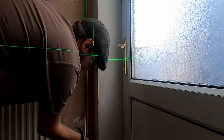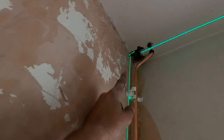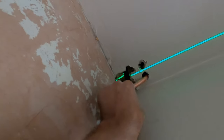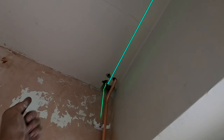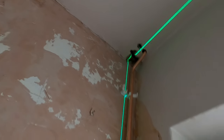I've got to try and hook this — I might need to shorten that leg a little bit. That fit first time, and it's absolutely perfect. There's a gap between the joists but you can't get 15 mil pipe through — it's one joist in the wall and then one further away. It's being overboarded anyway, that's why I wasn't too careful. That bend is as perfect as it can get. We kicked out and then across, and it fitted first time.